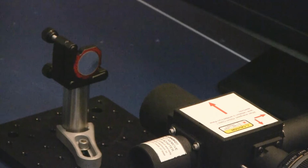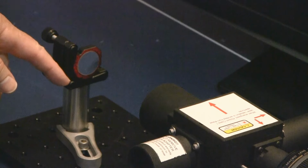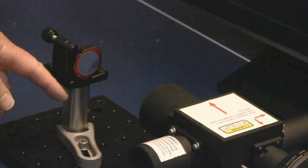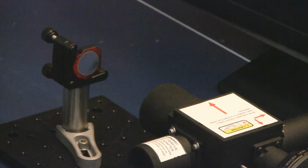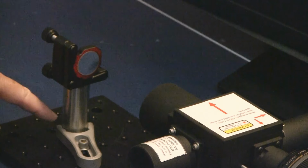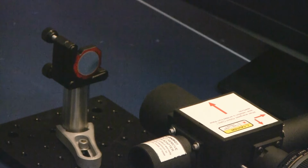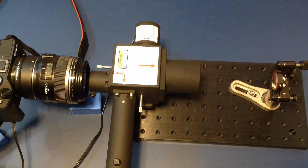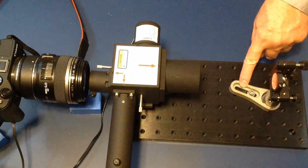The included concave test mirror is inserted into the 1-inch diameter mirror cell of the 5-axis mirror mount, and the set screw which retains the mirror is lightly tightened. Over-tightening the set screw will deform the shape of the mirror, which can be easily observed in interferograms of the mirror. After the mirror is installed, the adjustable mirror mount is attached to the longer mounting post, and the mounting post is attached to the base plate in such a way as to center the mirror within the footprint of the expanding beam produced by the SPPDI. The position and orientation of the mirror is then fixed to the base plate by tightening the mounting post clamp.